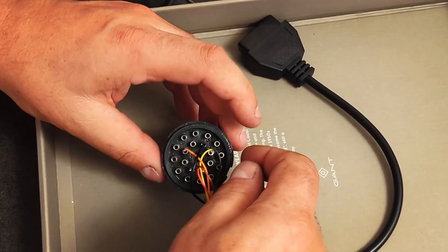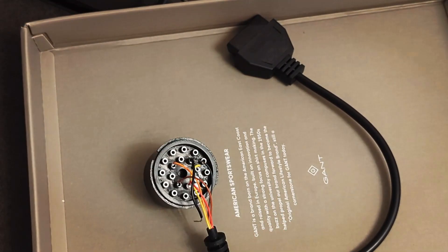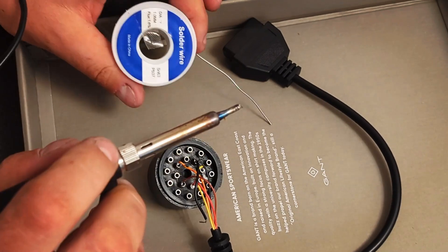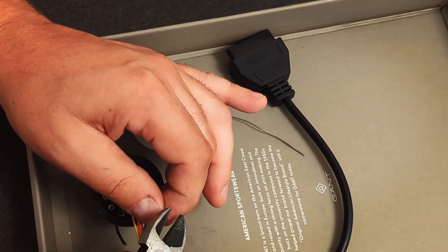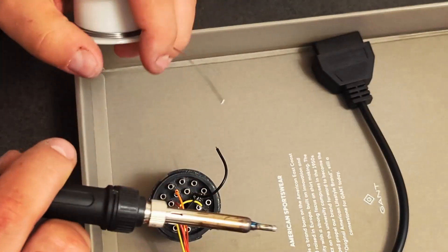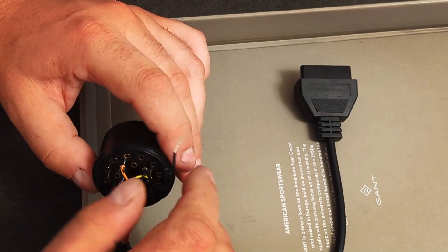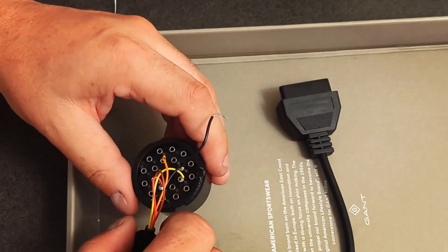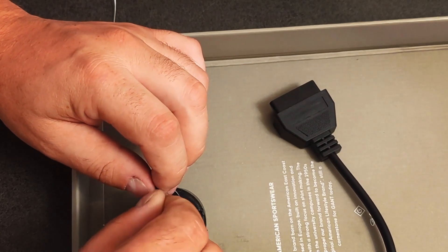I have a small jumper cable I made here. I'm going to solder it to pin 18 first — this thing is pretty hot. You have to be careful not to touch anything. I might have burnt the edge here but it's connected. I have to trim this off — it's really small in here and the iron is really big. Now I have the pin 18 jumper connected and I need to solder it to pin 14.